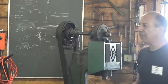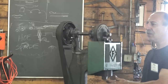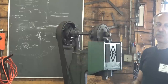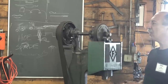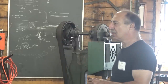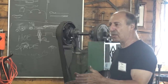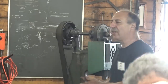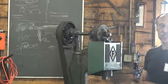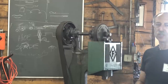So yeah, some of the steel did have grain that made that steel much easier to weld to a piece of iron or to itself. So people talk about how much easier it is to weld blister steel or shear steel than it is to weld cast steel. Not only would it weld more securely, but it could be heated to a higher temperature without damage. So the cast steel had some real disadvantages when it was new, but it was the most homogeneous product.